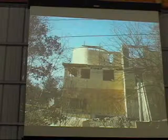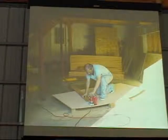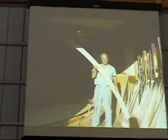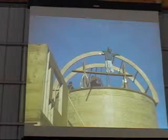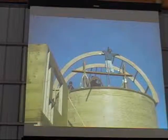So then we got the house built, and I took over the southern end of the house. My wife had the better view of the ocean, so we were both happy. Cutting out the panels the same way gives you nice smooth curves. Use waterproof glue just in case you do get a leak — use really good quality glue. Put lots of screws and you will have a perfectly made arch that is essentially indestructible. With just a couple of side supports, you can lean against it — it's perfectly rigid.